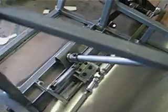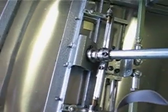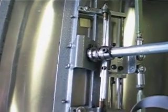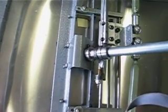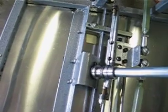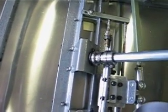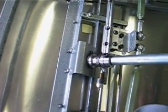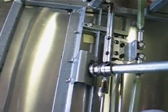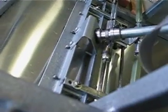The reason for using a cable rather than anything more obvious is partly because we decided in the beginning we wanted cable operated steering, and this is the remnant of it. But also because it's fabricatable in our garage here, whereas a rack and pinion gear system would not be. And it also allows a certain amount of tolerance in the assembly.